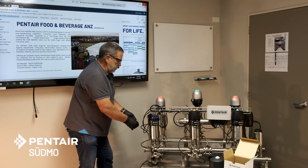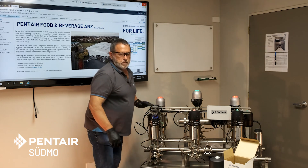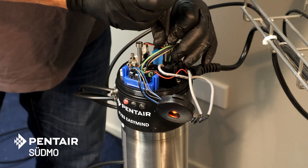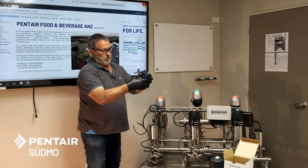We're ready to take off the control top — need to remove some hoses, and then with a 5mm Allen key take the extended bolts out and lift. There's our control top.